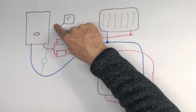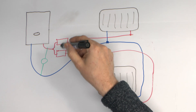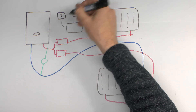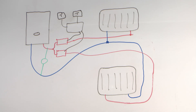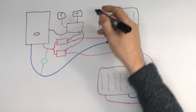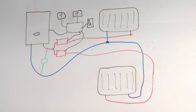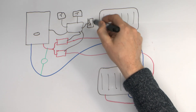In terms of the electrical part, the single thermostat connected to the boiler is going to go away, and instead we will actually need two thermostats — one for each of the two valves — and we'll also need some kind of wiring centre. All of these wire into the wiring centre, which is basically a big junction box. There will also be a cable coming from the two valves into it, and then another cable from the wiring centre goes over to the boiler. Power comes in from a 3A fuse connection unit, going to the wiring centre, so that when you turn it off it disconnects the boiler, all the thermostats, the valves, and the entire system — your single point of isolation.